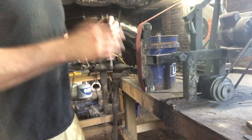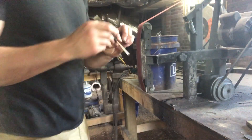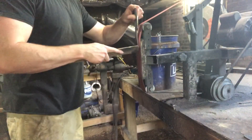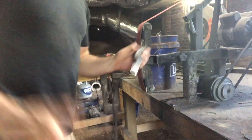Normally when I'm grinding flats on a blade, I'll just stick the whole knife on a welding magnet and surface grind the whole thing flat. But because I'm trying to leave this part of the knife relatively untouched, I'm just using a push stick. Just wanted to explain that to you real quick so you don't think I look stupid doing it.